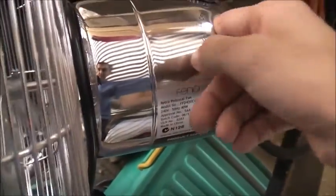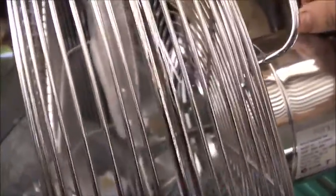Do some cleaning up around here. I need to see how I can mount that three-phase motor on this fan blade. If I had a lathe, I could actually turn that shaft in and tap a thread, and that will screw into the end of the shaft of the other motor — make some sort of coupling. You can't run these motors on three phase because of the way they're wired for variable speed — it will just smoke up. If I could find a small three-phase motor that has a shaft that size, it would be good. I'm going to dig out the other little motor and we'll see what we can do.